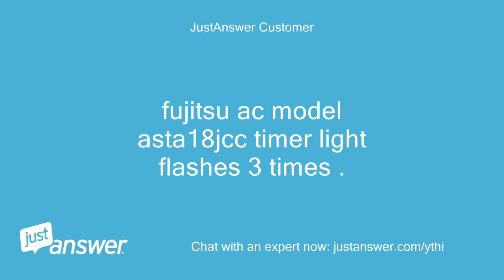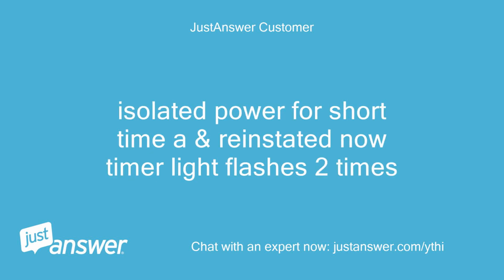Fujitsu AC model ASTA18JCC, timer light flashes 3 times. Isolated power for a short time and reinstated, now timer light flashes 2 times.